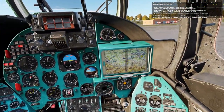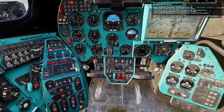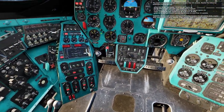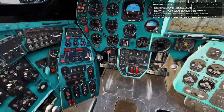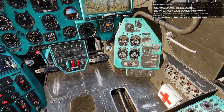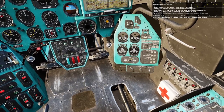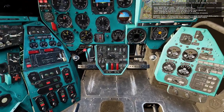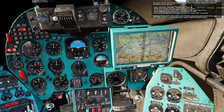Monitor the following parameters during spin-up. Green auto on and amber starter on lights up. Steady RPM increase and the main rotor blades start to move. Oil pressure at 45% of turbine RPM is not lower than 1 kilogram per square centimeter. The amber starter on light should turn off at 60-65% of RPM. The green auto on light should remain lit no more than 33 seconds.